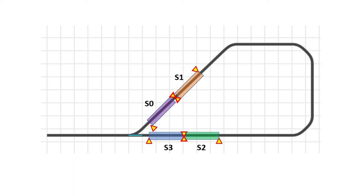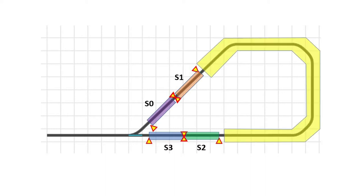Now the way this works differently from just having a normal device in such as the Gaugemaster DCC40 is that the polarity on here is not changed by a short circuit. The train comes off the main line and goes into these isolation blocks. The DR5013 picks up that there's a train there and says to itself, there's going to be an issue with polarity. So at that point, it changes the polarity on the main loop, which is now highlighted in yellow. It doesn't wait for the short circuit. It anticipates that, changes the polarity so that the engine can keep running and the engine is not actually causing the short itself. And therefore, you don't get even that minute bit of damage to the engine or its components. So that's fine, that sounds like a good way to go.